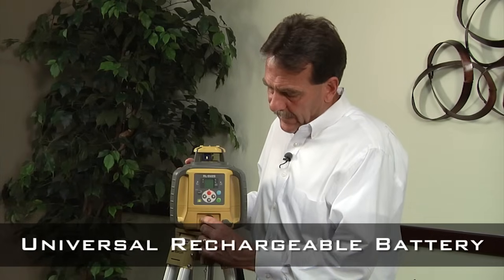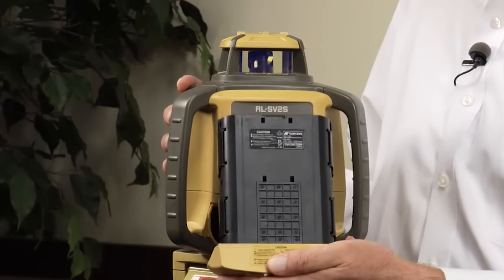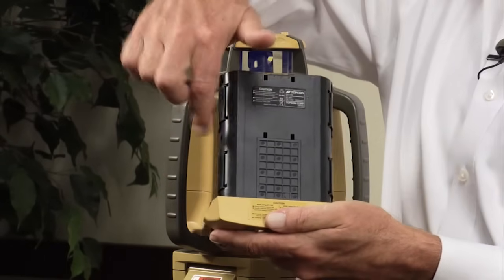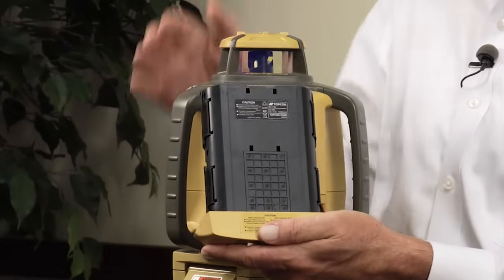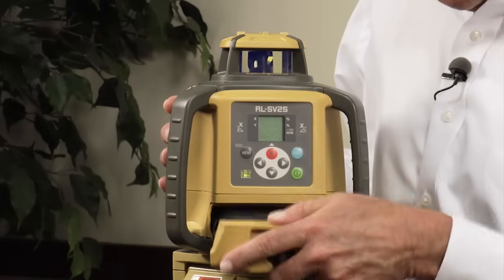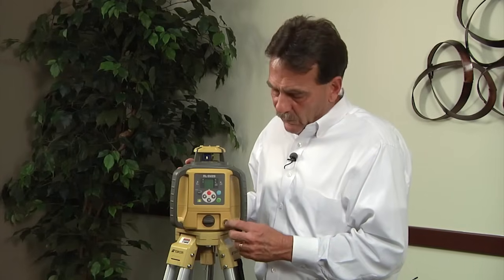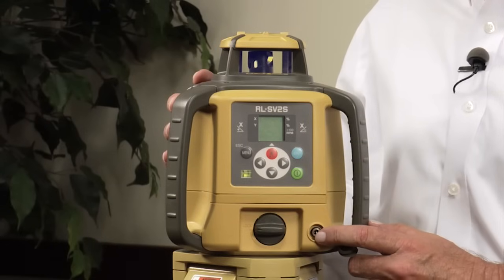This unit has a universal recharging battery brick built into it. If on the job site the batteries die or you forgot to recharge, the brick detaches with two clips, you put four D-cell flashlight batteries in, and go back to work. Also, if someone forgot to check whether regular alkaline batteries were installed and plugged in the 110 charger — whether for a day, a week, or months — the design ensures there's no electrical connection between the 110 charger and the D-cells, so you will not melt down your battery pack.